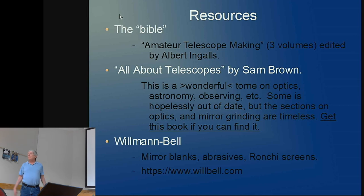But what does a 30-inch telescope weigh? A lot. I don't know. The tubes are usually truss designs to keep the weight down. But there's kind of an unwritten rule that the main mirror's thickness needs to be about 1/6 of the diameter so it doesn't sag. So picture a 30-inch diameter, 5-inch thick chunk of Pyrex.